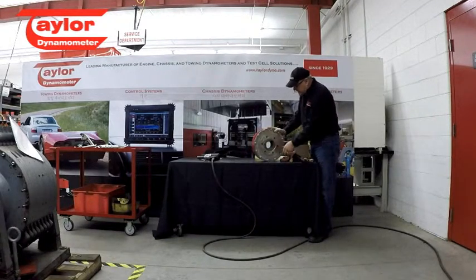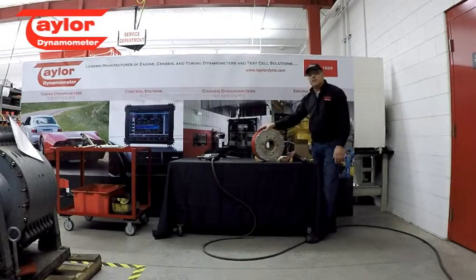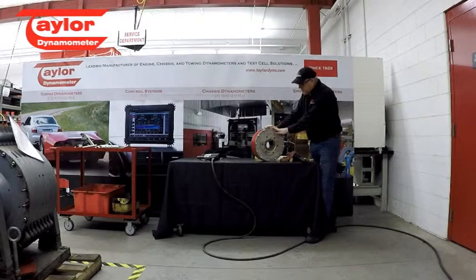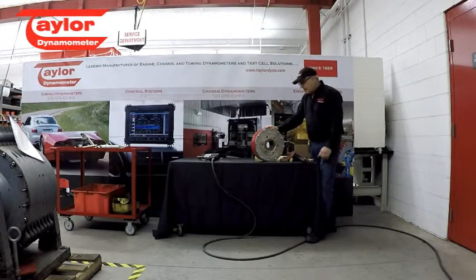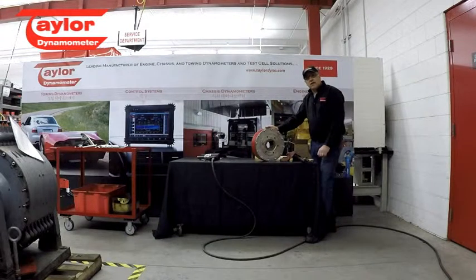One last thing: on the back side, or end plate, you'll see six holes. These holes allow you to lock this coupling up to a rigid-style coupling. The torsional coupling works great for engines up to about 3,000 foot-pounds of torque. Over 3,000 foot-pounds and you'll basically destroy the innards of this coupling. For any engines you run over 3,000 foot-pounds of torque, you want to get some grade 8, one-and-a-half inch long, half-by-20 thread bolts, put these in and torque them to the proper spec, using a hard flat washer. That will save the inside of the coupling — and of course, remove those bolts when running smaller engines.